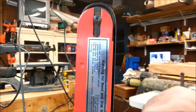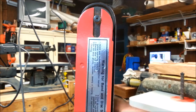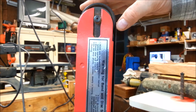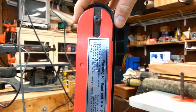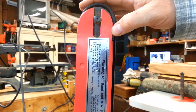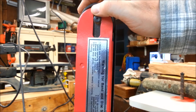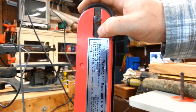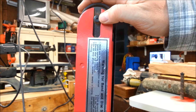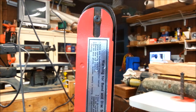There's a big gap here that I don't like. This flat surface - there's a sheet of metal back here called the platen - the belt should be up against the platen. There were several ways I could have fixed this: I could have made smaller wheels so the belt comes in closer, but that's complicated. I could have moved the slots back to where the manufacturer should have put them, but that would be a lot of work - I'd have to fill the gap with metal or make a plate to hold the axle, and I'd need modifications on both ends.